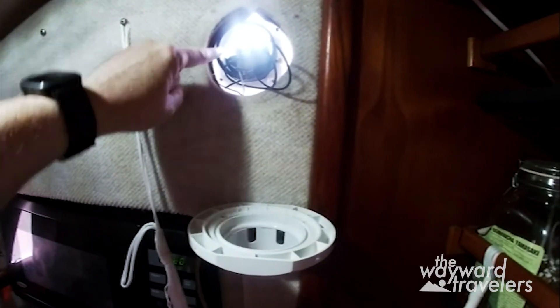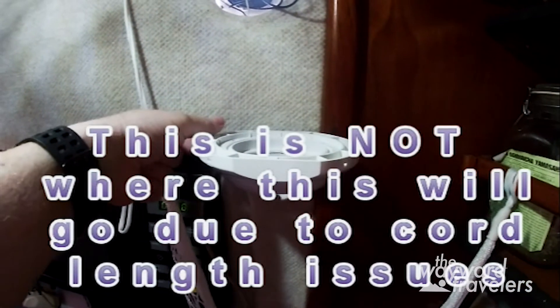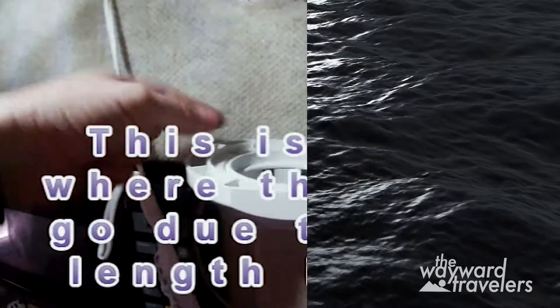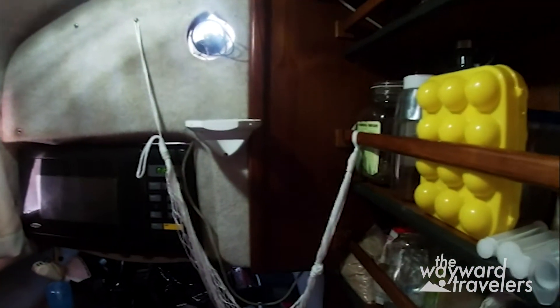I didn't want to get too close to our magnetic compass, so I'm putting our GPS here about six to eight inches down from it. It will sit inside the starboard berth that we use mostly for storage — nobody's ever planning to be in here. All the rest of the control stuff and steering is right behind there, so it keeps everything within reasonable distance.